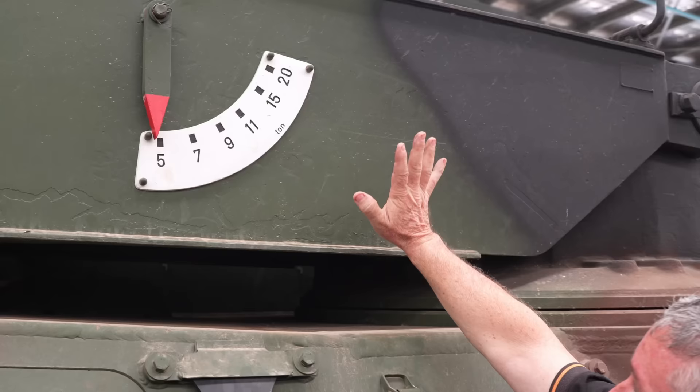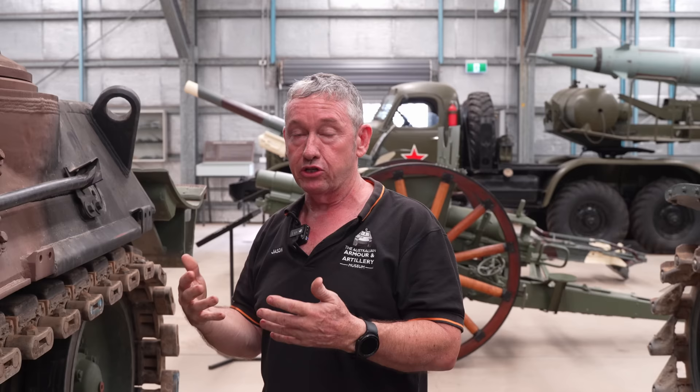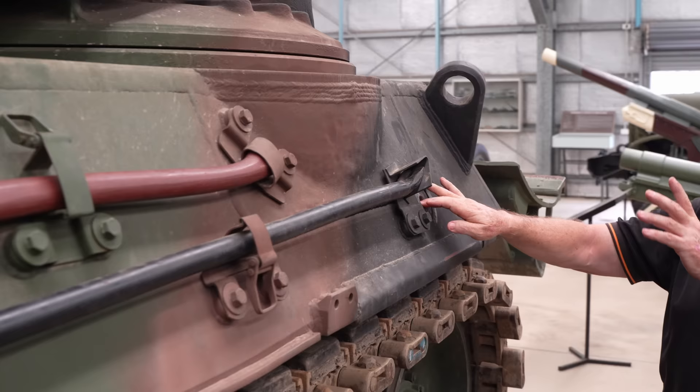Under these protective covers there are two large hydraulic cylinders which provide all the hydraulic power to lift the crane up and down. If at any stage we lose hydraulic pressure and can't move the boom, there is a process to release the oil from the hydraulics. Behind this cover there's a tool that fits in there and allows the crew to manually move the crane back to its stowed position.